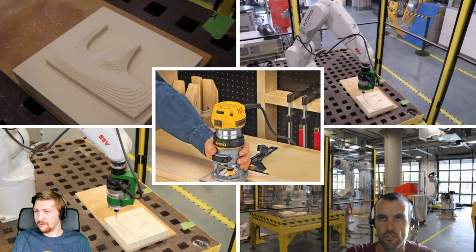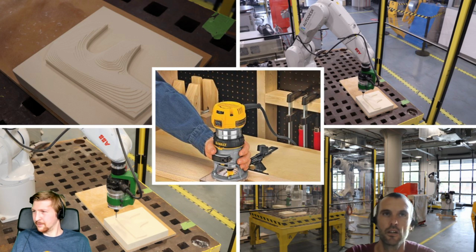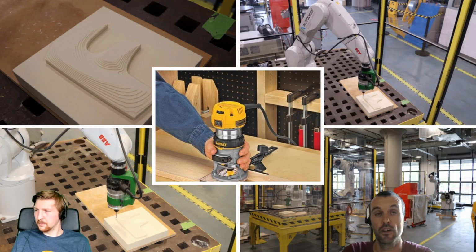Yeah, and also if we focus on what type of materials people are processing with subtractive technology using robotics, it's never going to be the metallic materials. It's always going to be non-metallic. So foam, composites, wood, tooling board, all those type of things, EPS foam. So there are so many applications where you can use a robot. The precision of the machine will be enough. The type of materials that you're going to be processing are going to be okay with it.